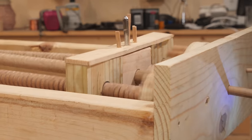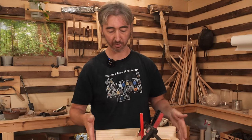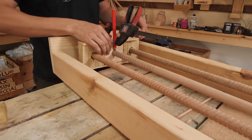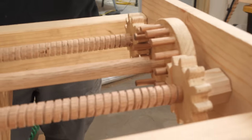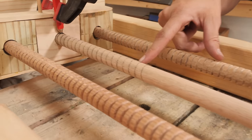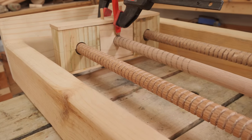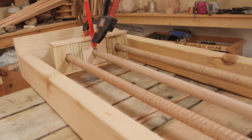This is what we have assembled so far — our screw making machine minus the cutting tool. Currently we just have a pencil hooked up so we can gauge the thread. We have a basic frame, a cutting tool guide block on one end, two threaded rods, and the rod set up to be cut in the middle, which slides freely inside the jig. On the opposite side we have a basic three-gear system. It looks like we lucked out with the gear ratios — it'll be cutting threads at about half an inch or a little over. As you advance the gear system, it'll pull the block forward, ride along the center thread, and slowly cut into it.